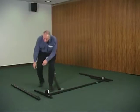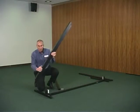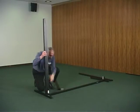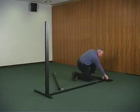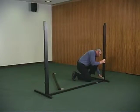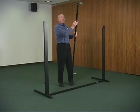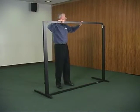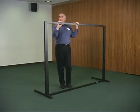And then the uprights are installed. Again, the uprights are installed with the snaps toward the back, the tightening screws, lower side toward the outside, and it slides into the frame members. Repeat the process on the other side. And add the upper screen frame member again with the screen snaps toward the back. And the frame is assembled and ready for installation of the screen.